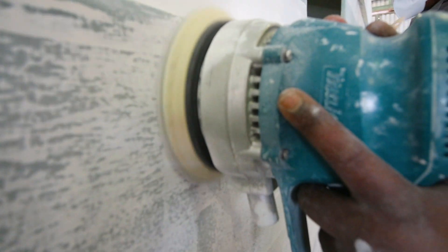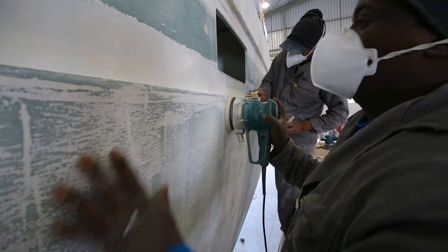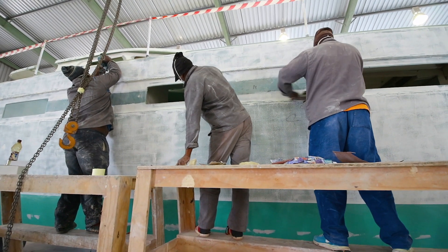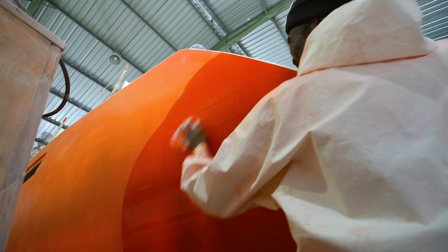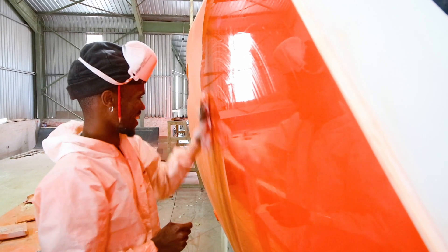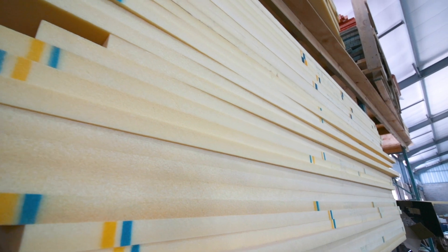The thing with epoxy is that it goes off warm, so epoxy boats need to be faired. That's the reason why on the 526, the 620, and the larger cats we build in epoxy, they're all spray-finished when done. This dramatically increases the labor associated with building the boats, but at the same time leads to a very light structure.